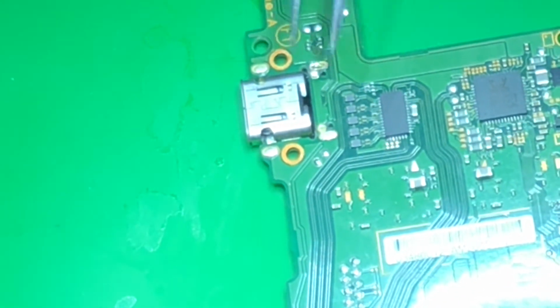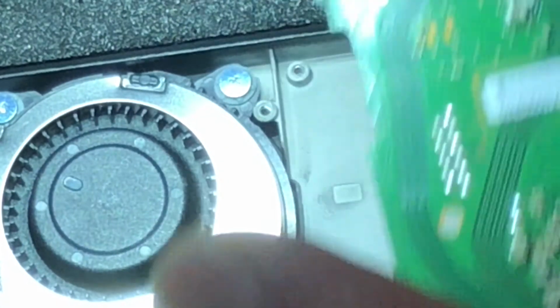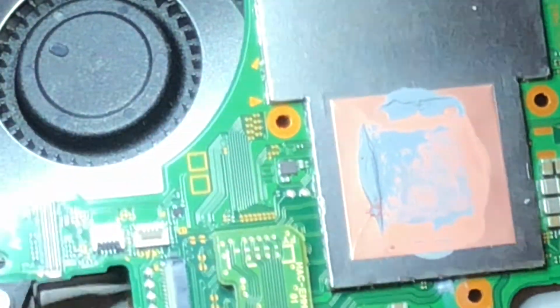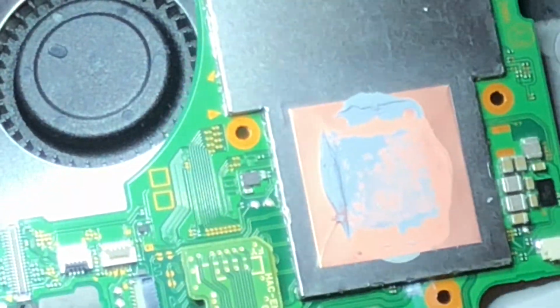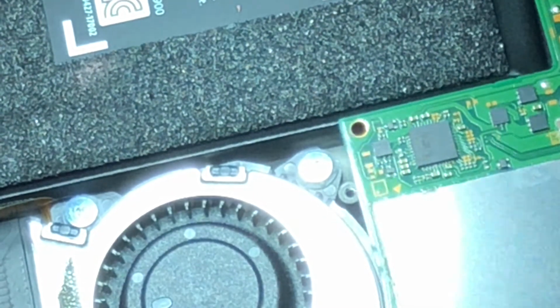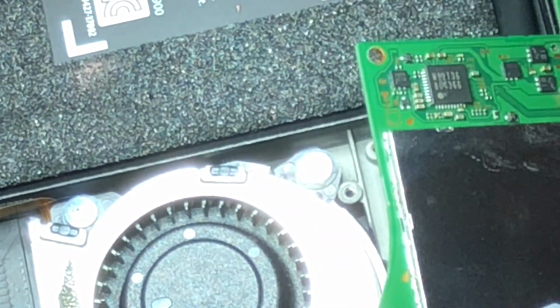But back to my original discussion here, you don't want to just take your hot air station and crank it. That's not the purpose of it. You want to learn where things melt and learn how much heat is going to be sucked out of that board, and then learn where to set and how close to hold your air. There's a lot to it. It's not complicated, but most of it's going to be by feel. You have to feel where your equipment's going to be. So, I mean, that's kind of the big thing there.